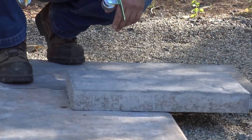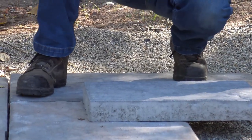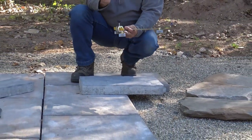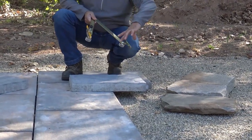Another thing you want to do is accommodate just a little bit of space. Because when this paver is here, we're going to want to allow for a poly sand joint or an easy joint right here. So I open it up about a quarter of an inch just to allow for that. So this is what I want to cut out — this distance.